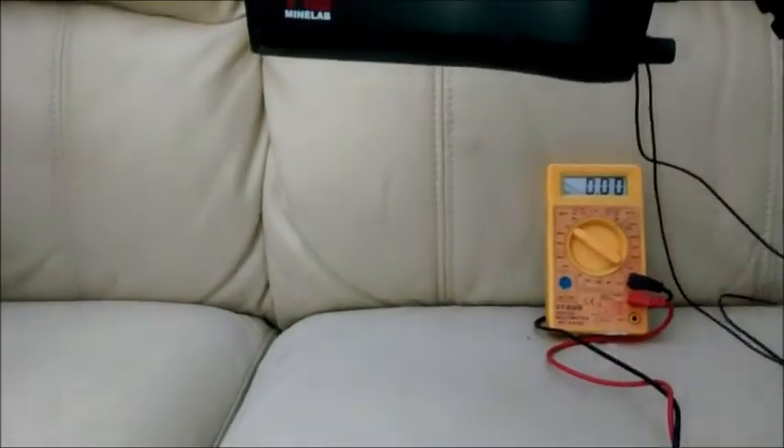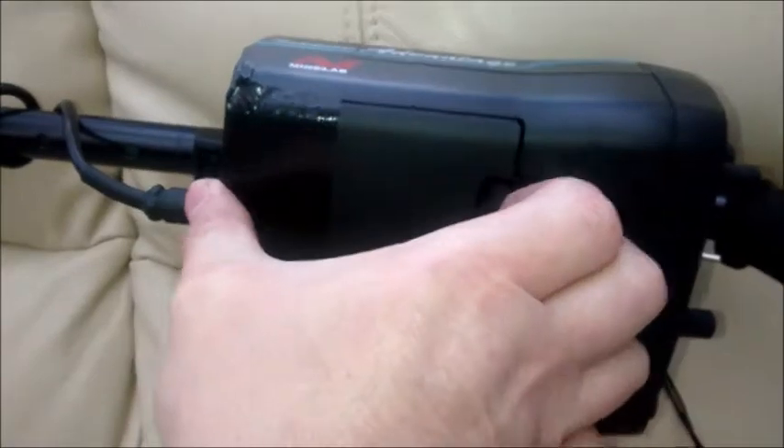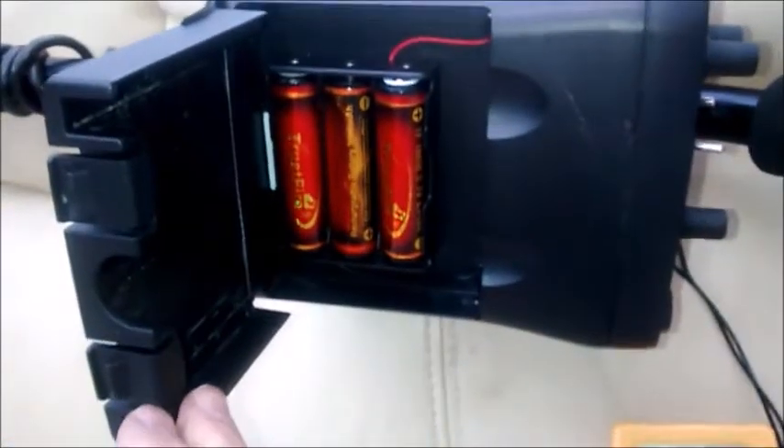The three batteries drop into the battery box. Now I've done all the work - as you see it hinges on gaffer tape there. You disassemble the old alkaline box, take the top part off, leave the bottom, discard the old batteries. Secured via the gaffer tape. If we just clip that undone - one, two - inside there we have the three 18650 holder. Slop back in there. Three 18650s in situ.